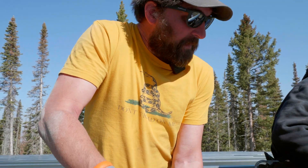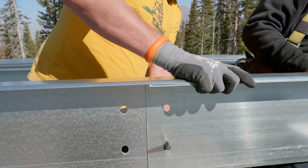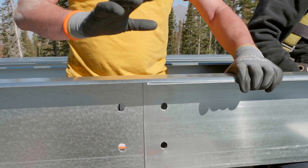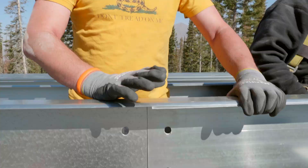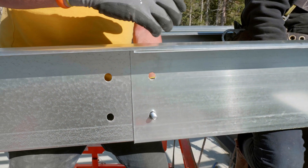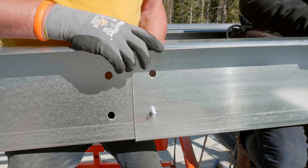This is a really tight joint here. A trick I like to do — if you're having a hard time lining these up, depending on the height of the rafter, the deflection on the rafter will cause these holes to move around a little bit. A cool trick is to come in and go ahead and set your lap bolts first — you've got a washer and a nut.